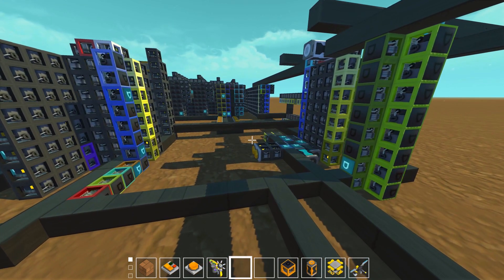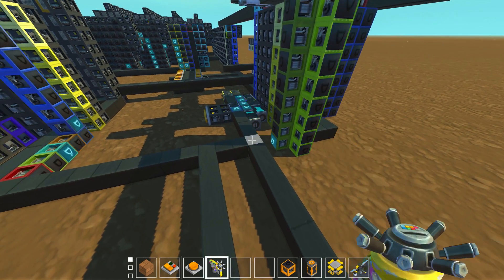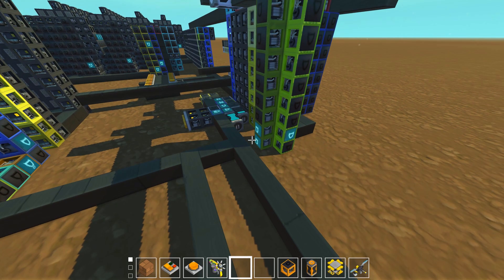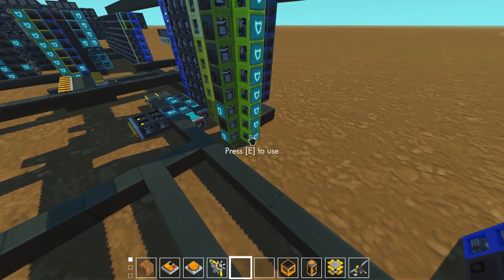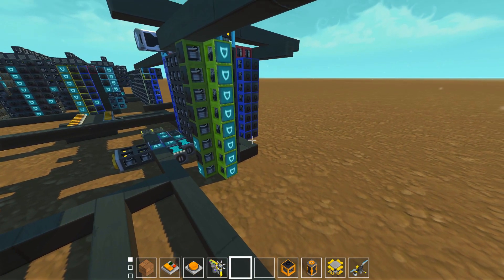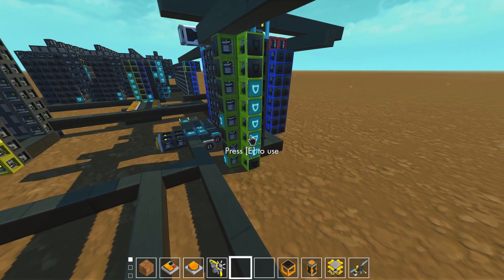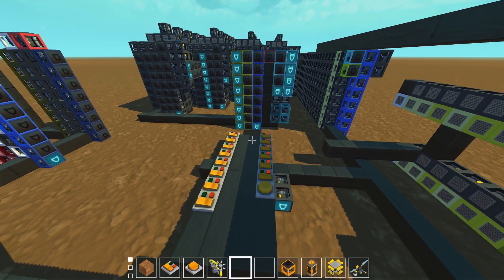So this is what it looks like in operation now — finally I get that out of the way. You can see there that each instruction fetch sends out these two bits the same each time because it's reading each even and odd address, although you can see this one is oscillating between the main fetch and the operand location.